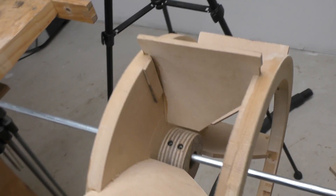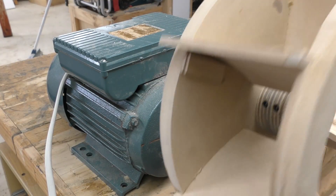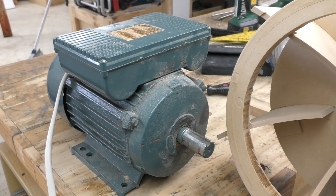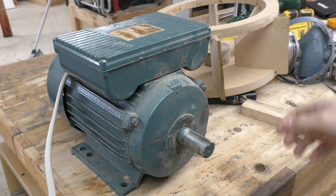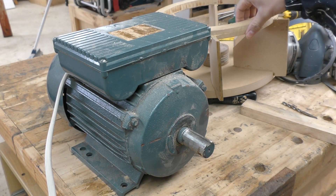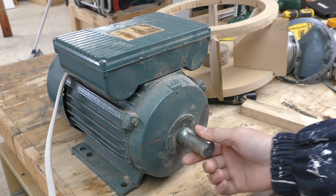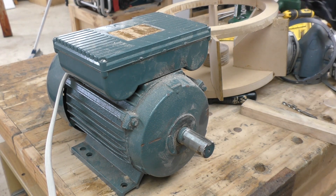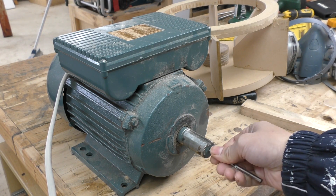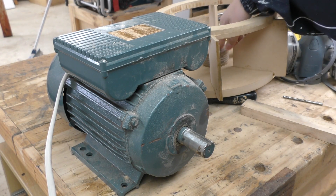Once I've got it all figured out I'll glue that on. I've realized that it will be extremely unsafe to attach the impeller with just two set screws from the side onto the motor and nothing on the face to hold it against gravity when the motor is turned upside down. Gravity will help pull the impeller out of the motor and the impeller might drop out, which will be extremely dangerous. So what I've been thinking is to drill and tap a hole right in the center of the shaft and then put a bolt through to hold the impeller in place.